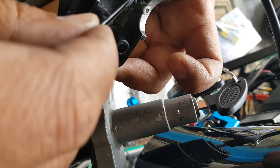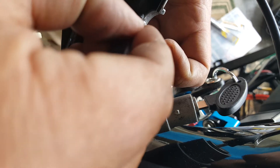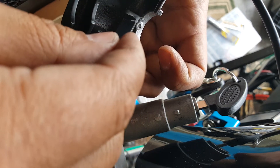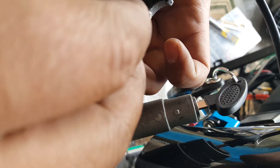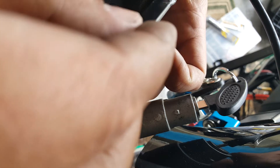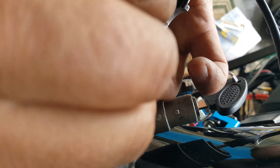This is a really easy JB Weld job. This area here doesn't really matter — it has plenty of slack room. But this one, if you mess up you can always sand it down too. JB Weld is not permanently like steel or something — you can sand it with sandpaper. I'm going to get into that little crud here too. Just want to make sure you pack it in there — just like soldering, you want to make sure it gets into the crack. You can see I'm forcing it in.